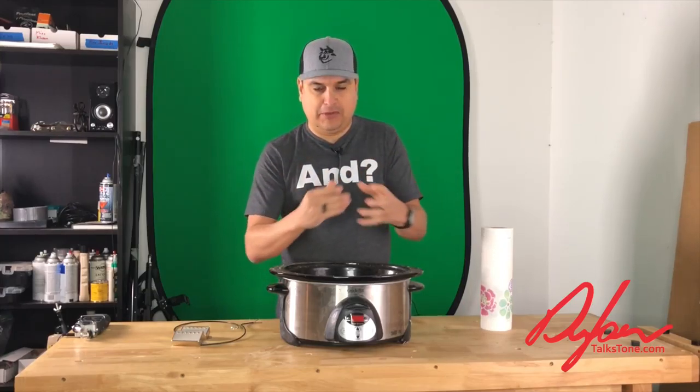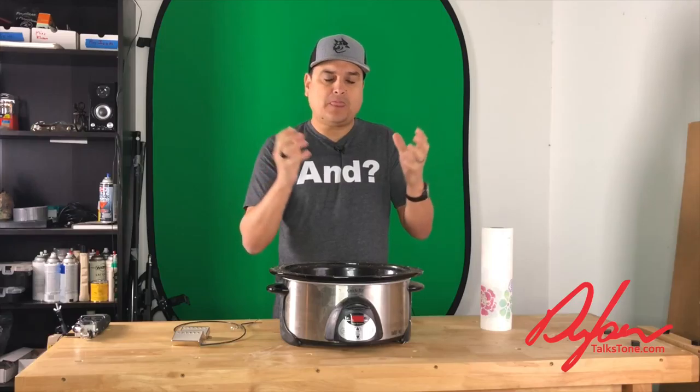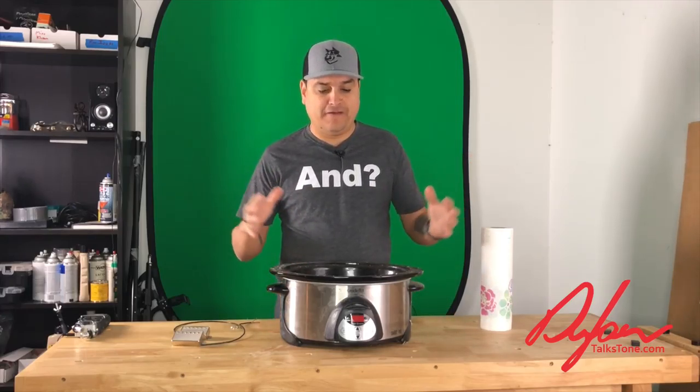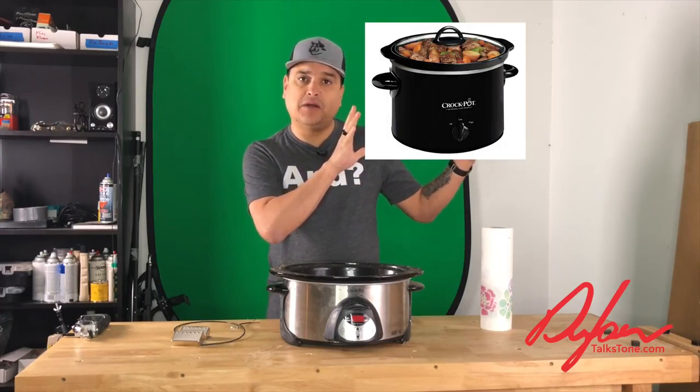The wax works its way in there. You can do this to any number of levels — you can go very briefly and just do the big parts, or you can leave it in there for quite a while and go all the way inside the coils, in between each coil wire, and dampen all of that. As for what to use to wax pot, there are very fancy systems with vacuum to push wax all the way in, but a lot of smaller operations like myself literally just use a glorified crock pot. I have a crock pot right here.